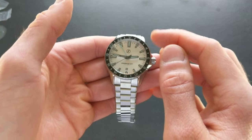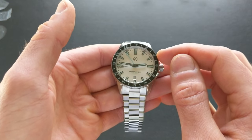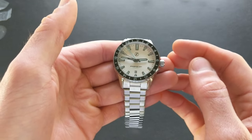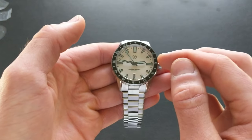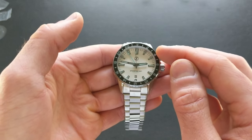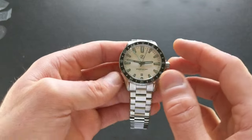Before they had the LJP movement, which was exciting to check out. Now they actually have a Sellita SW330-2, which is similar to the ETA 2893-2. The dash-2 designation is important because it kicks up the power reserve from around 40 to 42 hours up to approximately 56 hours — so that's a great bump there and exciting to see.